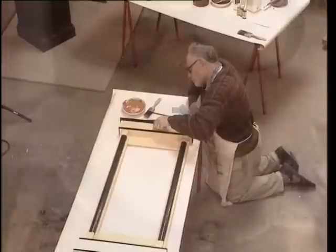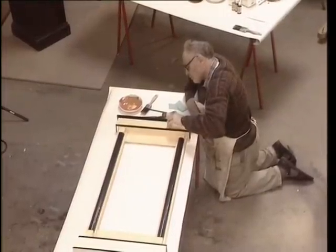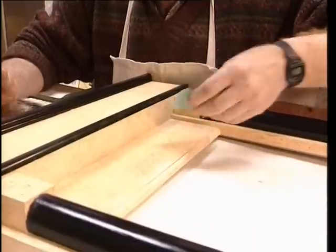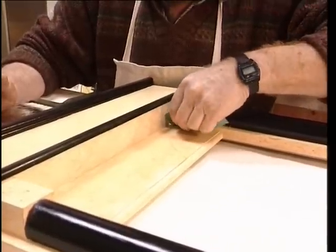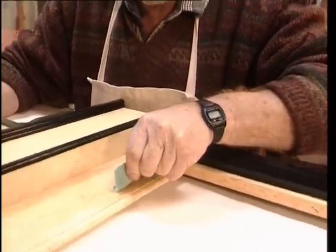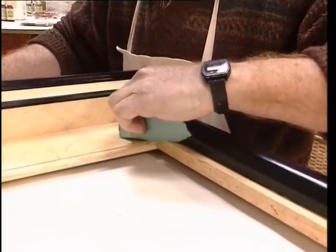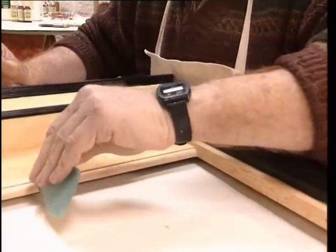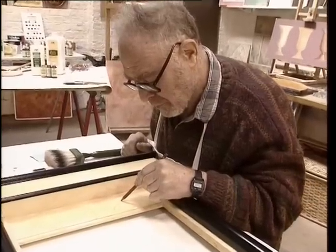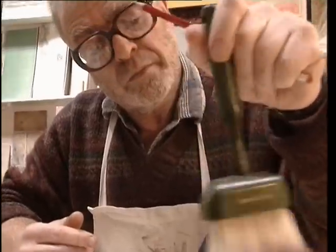Harry is currently working on this mirror frame in the Biedermeier style. It combines bird's-eye maple with black colouriser in acrylic lacquer. The water-based media are excellent in that the first coat dries fast, particularly if you've got a hot air gun. And then you can go onto the second glaze coat and create the little grain lines with a piece of card. That's a useful trick. And then the traditional way of getting the harder lines of grain with a crayon can be added. And you've got the whole thing completed in one stage, really.